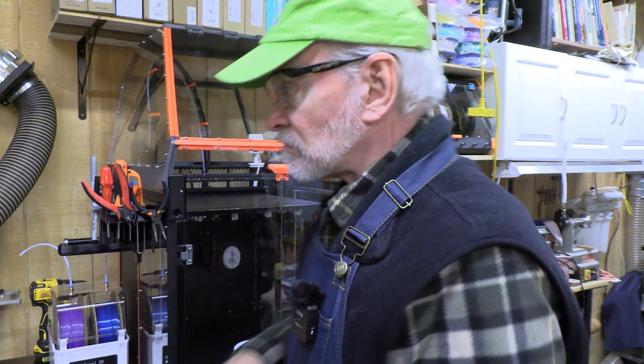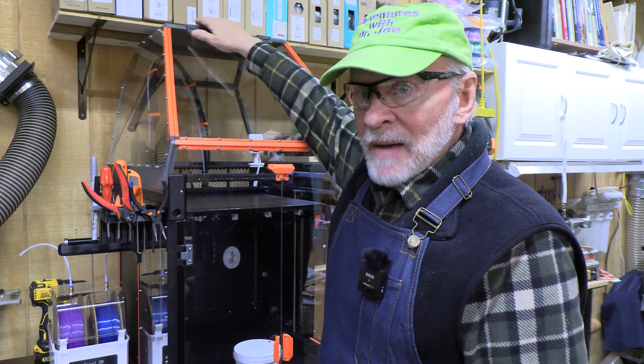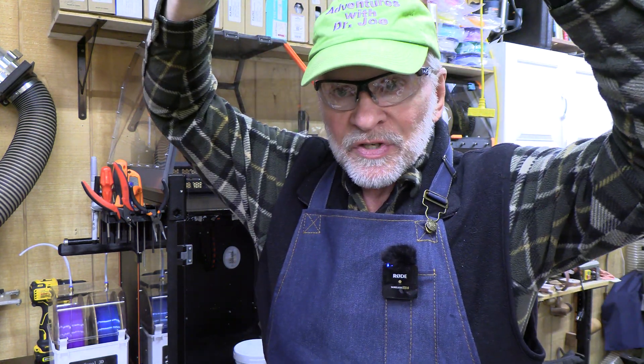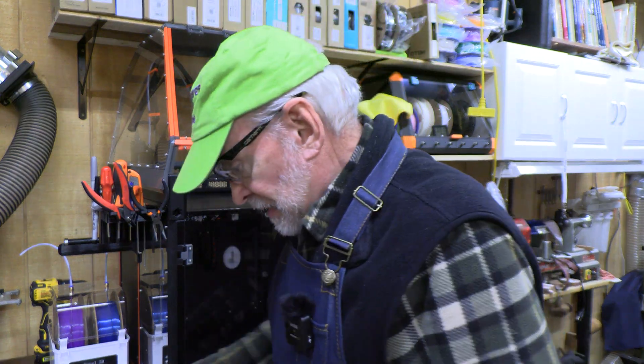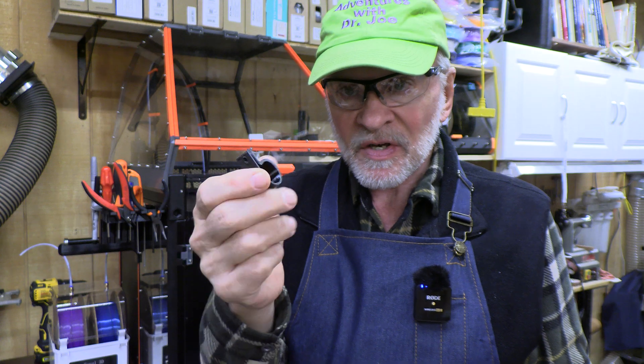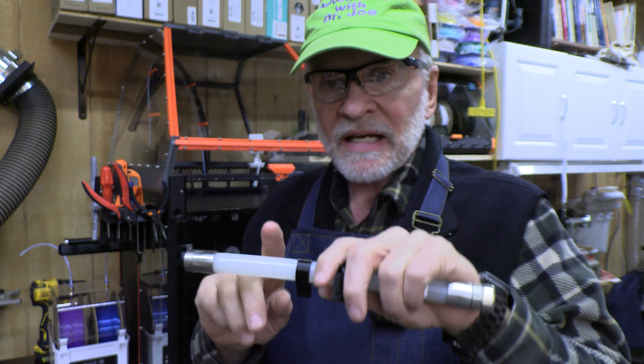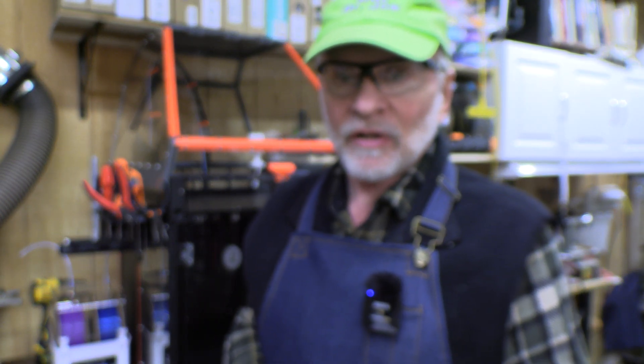To mount this, I'm going to mount it under the top edge, because you want it high so it can disperse the fire retardant down onto the fire. I've printed these very simple connectors — I'll put a link to these. I also put a link to the Blaze Cut; there are many different sizes: a large 100, this 25, and a 50. Pick the size that is good for your enclosure.